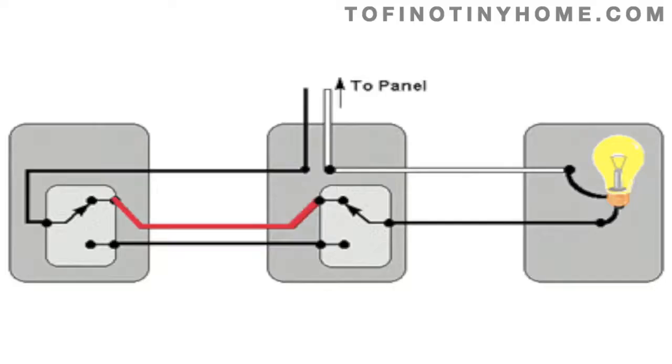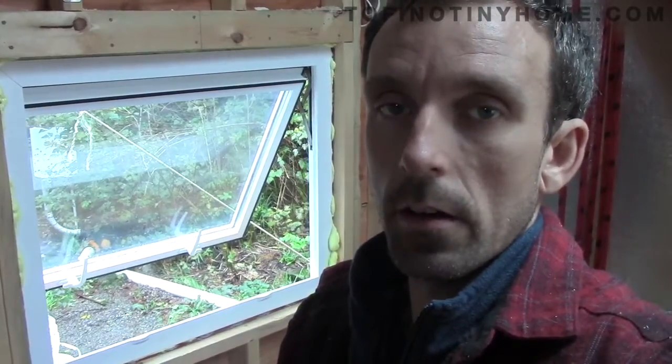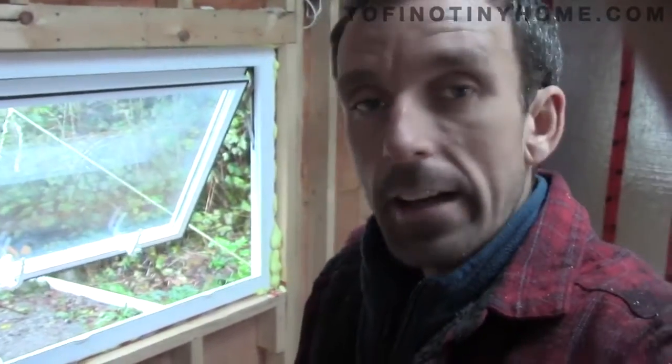I hope that makes sense - it makes sense to me, and I'll throw up a diagram which makes it way clearer. But it works and it's great. You just need those on-on toggle switches if that's what you're going to use, otherwise they do make three-way switches. Instead of using that single black cable, if you're using 120 volt lights you can use a 14-3 with three conductors in to save you running that single one. But it works great and it's 12 volt, so it's a lot less dangerous to work with.